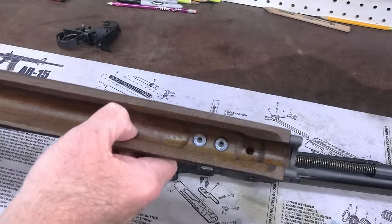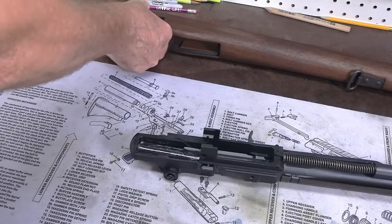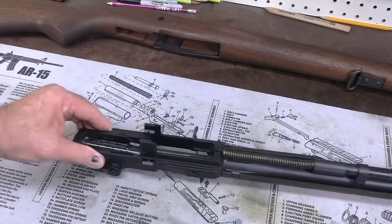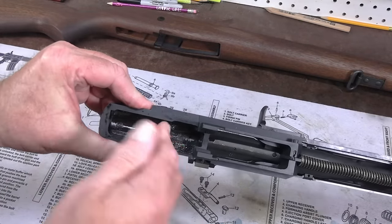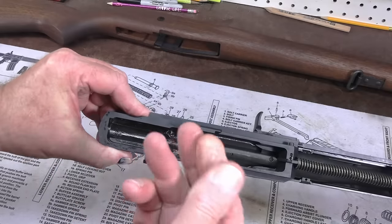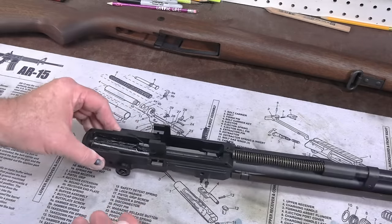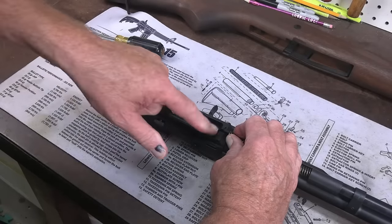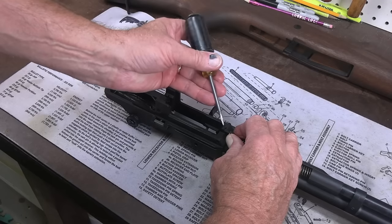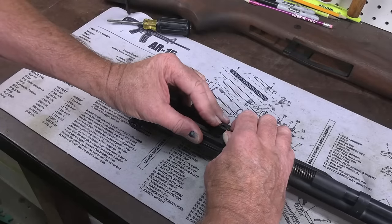You can see the receiver liner — the stock liner that mates with the receiver — nicely milled. A lot of fine workmanship here, a lot of nice milling. This is military grade all the way. The receiver is all greased up — that's a white grease, looks very much like plain petroleum jelly, which is very effective for preserving things like this. You want to pull the spring firmly forward until it relieves the pressure on that part of the spring guide, then pop this roll pin straight out, which disengages the spring guide.